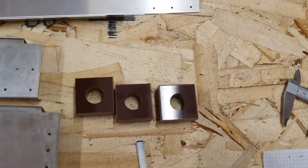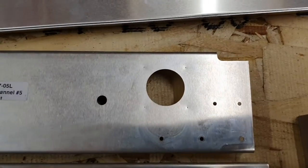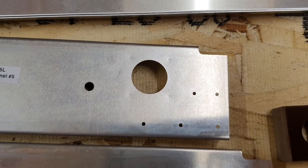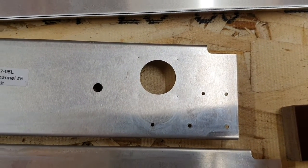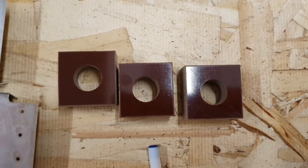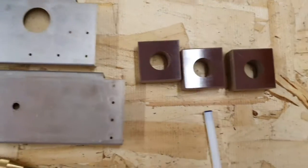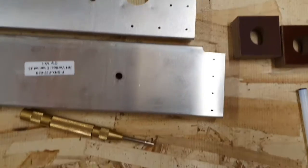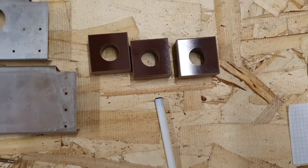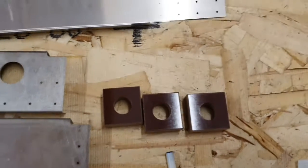Now what I've got to do is mark up the holes — these are the holes they're going to fit over — and mark the places for the four rivets to go through to hold them on. Then once I've drilled those in the metal, I'm going to drill those down through the phenolic as well, using the metal as a guide. They'll all be individual to each one, so they'll all have to be numbered, because I can't guarantee the holes will be in exactly the same place on each one. So I'll drill those, then drill down through the phenolic and rivet them on.